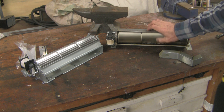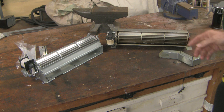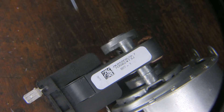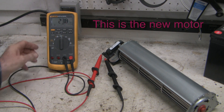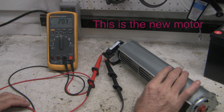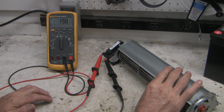These are low torque motors, so that slight difference may be enough to cause problems. I'm not unhappy that I got the whole assembly. In case you need them, here are the markings on the new shaded pole motor — the old motor had no markings at all. Measuring resistance on the new part, it varies as I rotate, and interestingly it's outside the normal range for factory specs, so they've obviously changed the manufacturing criteria.